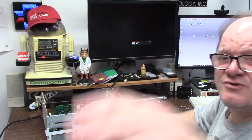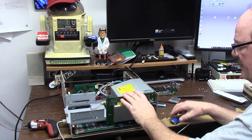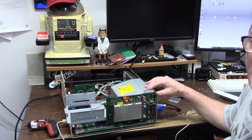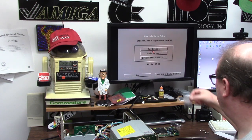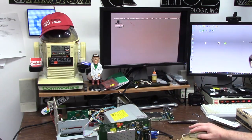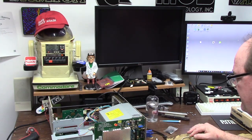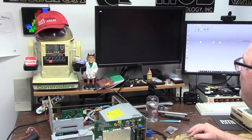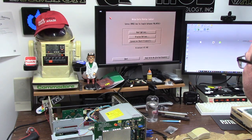This is the recent acquisition — I traded for this, so we're going to put this one in. Same scenario. This has a busted switch, however it looks like it's jumpered for amber being enabled. Turn it on again — double mouse button to see if it turns blue. This one looks fine in early startup. Booting it, looks the same in workbench. I can't unfortunately disable this card because of its broken switch. I have one of these switches on order from Mouser and it should be here in a couple weeks. Flicker fixer flicking is working. Switch enabled: 31 kilohertz, nice and clear.